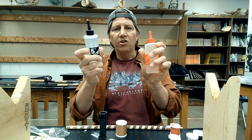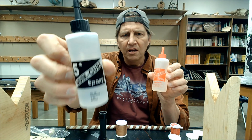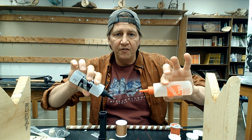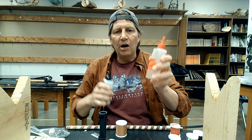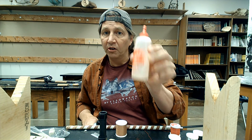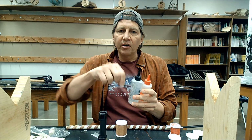And so you're going to need to use epoxy, 5-minute epoxy. There's a resin, right here is the resin, and then the other one is a hardener. You want to mix these exactly 50-50. So you can use a disposable cup and just a little bit, 50-50. I would go a little bit extra hardener. Otherwise, if you do too little hardener, it's not going to get hard. Common sense. So I would err on putting too much hardener in. Stir it up, mix them up.